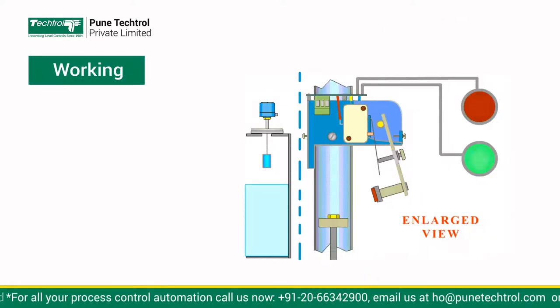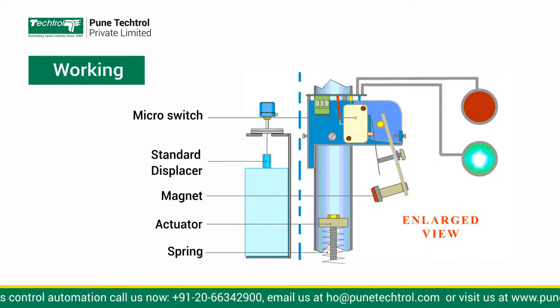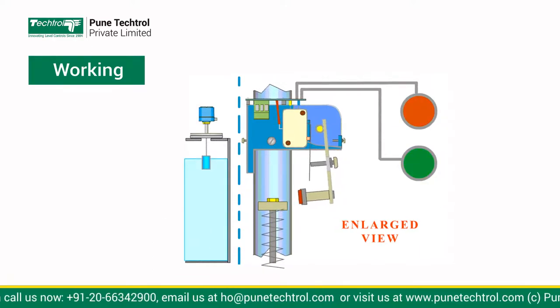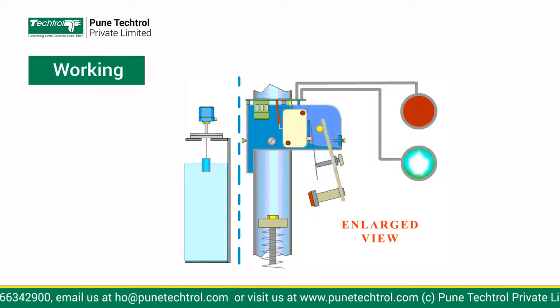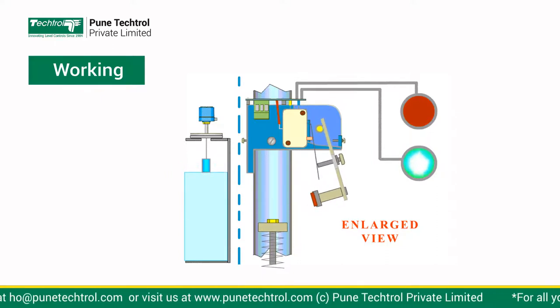Working. During rising level, displacer gets immersed in liquid, undergoes weight loss, allowing the spring to expand. It causes actuator rod to move upward in seal pipe and attracts magnet by pressing micro switch lever to actuate.